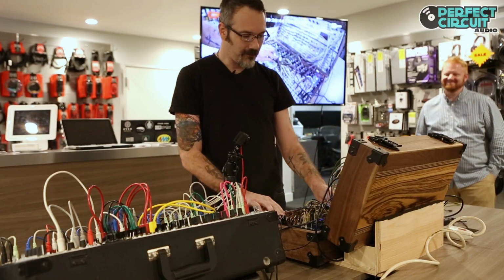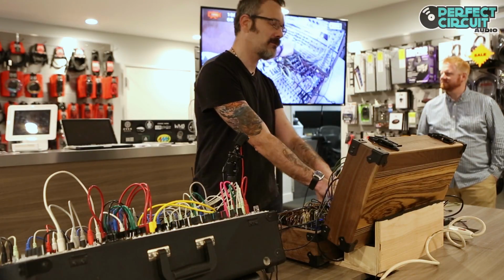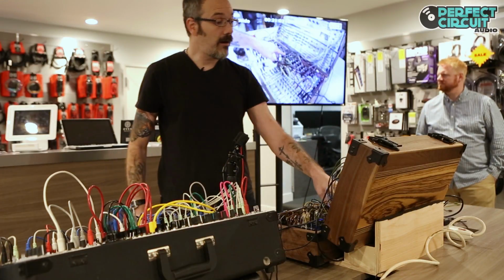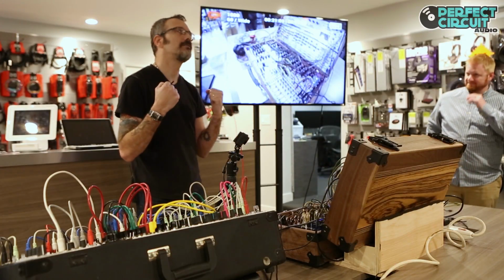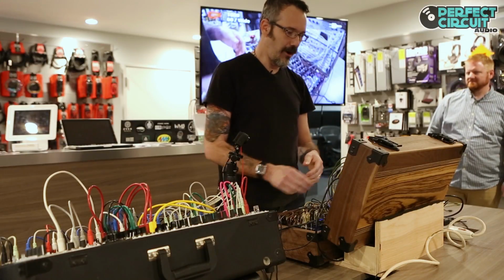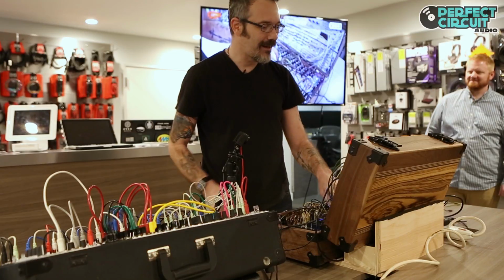The melody in the first couple tracks and the bass in the last one was our Proton module, which is our Karplus-Strong. One thing that we've done with Proton that the one thing I hate about Karplus-Strong is it has no bottom, which makes it suck for electronic music. Everyone's always talking, does it do Karplus? You got this delay, can you Karplus with it? So we made a Karplus-Strong module, and because Karplus has no bottom, we added a sine wave.